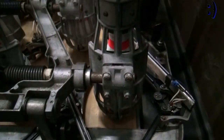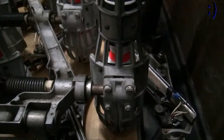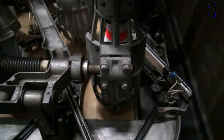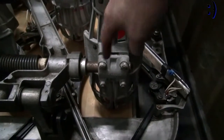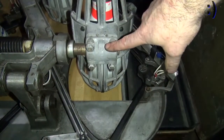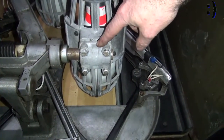So this is the point at which you adjust all the spotting cups to place the pins on spot. The spotting cups have 2 adjustments, left and right, and forward and back. To center the pin on spot sideways, loosen the top 2 or all 4 of the bolts on the cap for the spotting cup and slide the cup left or right until it's centered on the spot, and then tighten them down.